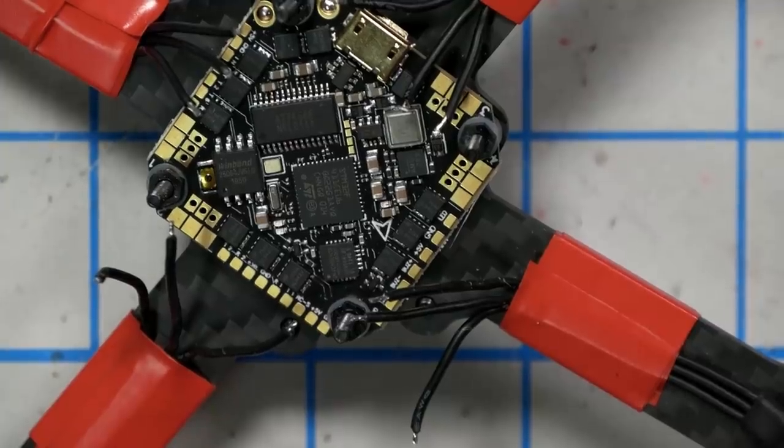When you cut the wires to length, you want them to be about the same length or a tiny bit shorter than the pad that they're going to solder to, so they don't stick out in either direction. Usually on the stuff we're working with, a length of about 2 millimeters, maybe a little less, is good. Next, we're going to tin all 12 of the motor pads. There's 16 screws and 12 pads. We're going to tin all 12 of these pads.